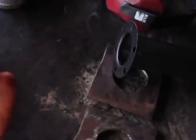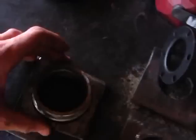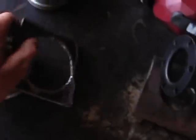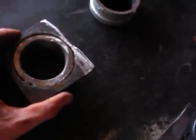And this one is bigger to take this, I think it's 2.5 inch coupler cut in half. Basically cut in half to keep one side of the threads. As you can see, there's the other side of the threads, and I'll weld this. I'll tack it on like that, and then spin it round, weld the other side, weld it flush with the edge, and then once that's welded in, that'll go on to here. Weld that on the end there,